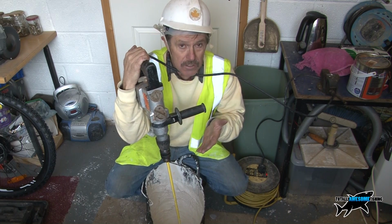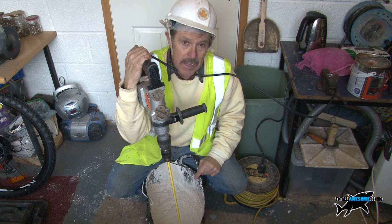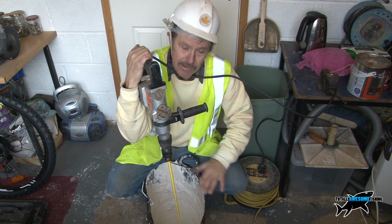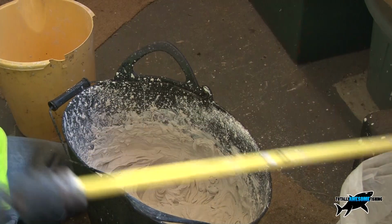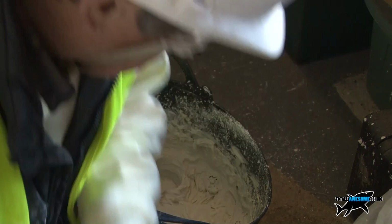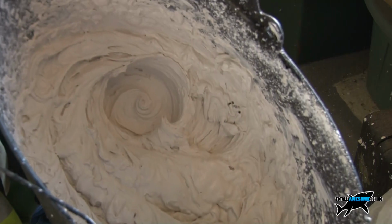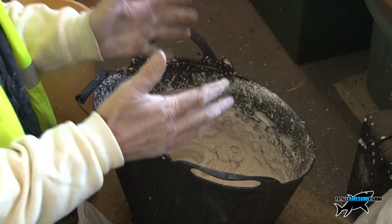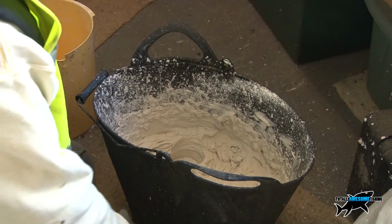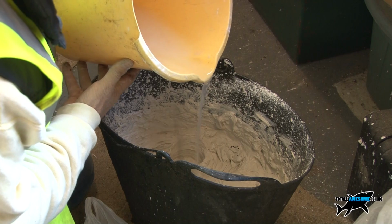It's not like plaster, where it goes off hard almost as you're putting it on. This will keep to the next day, and the way you do it is to cover it with a film of plastic. Finish my whisk in there, and what I do is just leave that, as you can see, it's lovely and creamy. But let's say I was going to use it tomorrow, or it's left over from today. I just give it a little bit of extra water on the top like this.